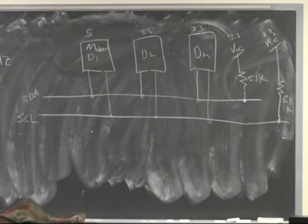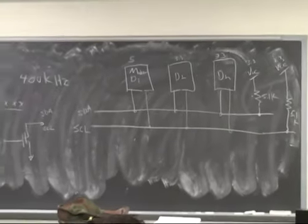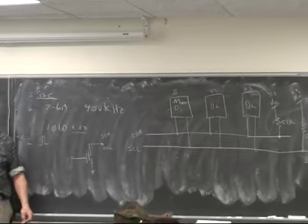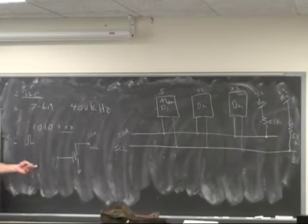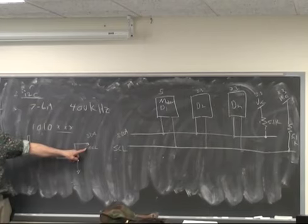I've noticed that some UART communication requires a pull-up as well between microcontrollers sometimes. I'm assuming it's the same behavior. Probably, this is for UART? Yes, but usually only on the TX line. It's probably because it's open collector or open drain or whatever you want to say here, but I don't know for sure. It depends on the device.